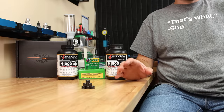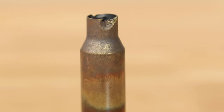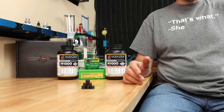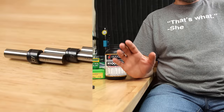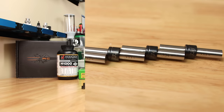I only started out with 20 pieces of brass for today's test, and I had to use one to generate my annealing code, so that left us with 19. All were annealed and full length sized with a Redding S die with various bushing sizes. I did double check all these bushings with pin gauges, and every one measured exactly what it was labeled.